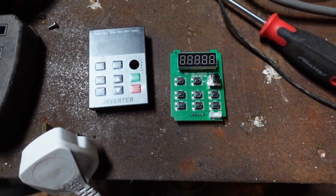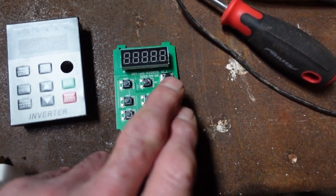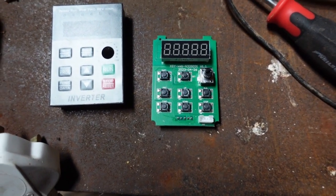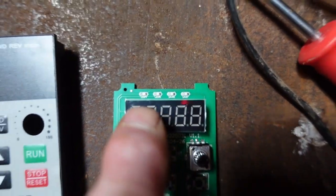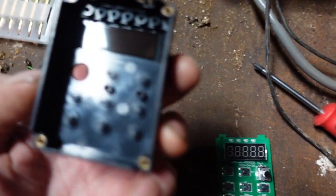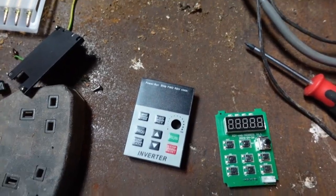For no better reason than curiosity I had the back off this control unit and I measured the pot — it's a 10k pot. So that means you should have a 10k pot for your remote pot if you fit one. I also noticed there are only four LEDs where there are six windows for LEDs, so whether they don't light up or don't operate in those modes we'll find out later.